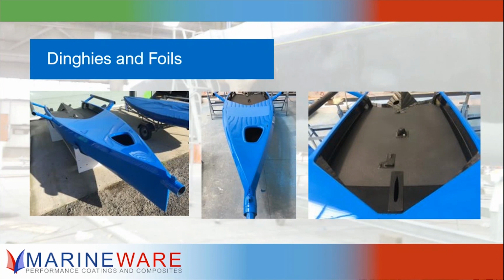So bare pre-preg carbon, and we ended up gluing it all together and then finishing it off. Okay, so did it take fairing, or was it just straight in with a high build? Did you high build it? We just Durepoxed it. So the hull was good enough that it was fair enough just to be primed with a few coats of Durepox, a bit of filling around the hull to deck joins and where we bonded the deck on, and then it was just a couple of coats of Durepox primer, flatted back, and then a final coat sprayed on top.